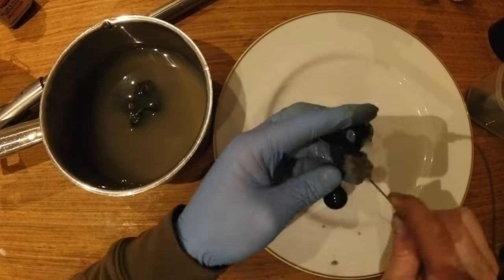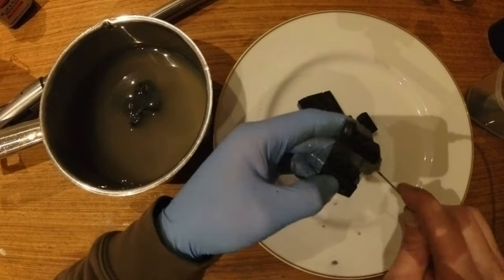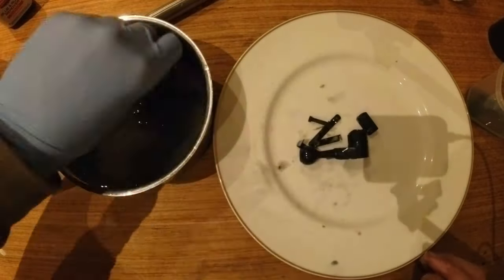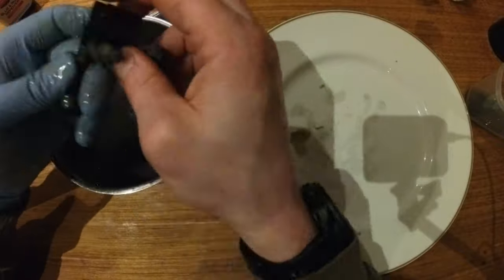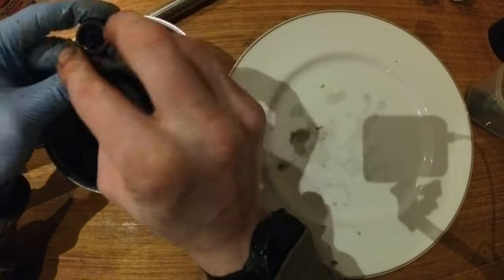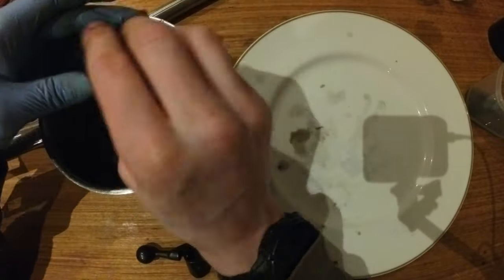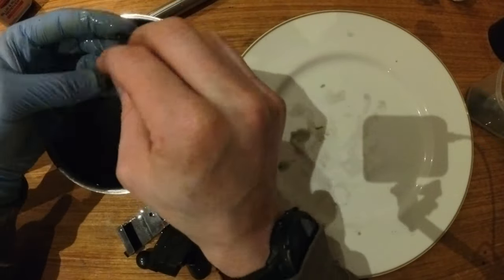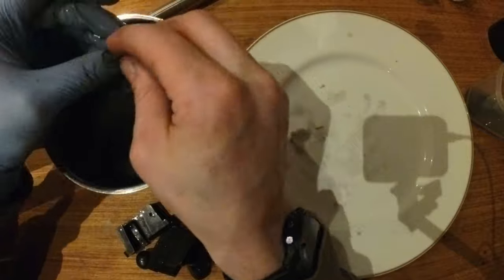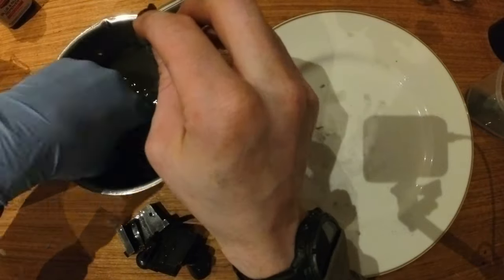After you've finished and the parts are dry, you need to leave it overnight soaking in oil. I just used gun oil for this, and the results were great. What I did notice though is parts with less oil on did dry out. I simply applied another coat and it had no detrimental effect to the finish, but just be wary to make sure they're well oiled if you're leaving them unattended.